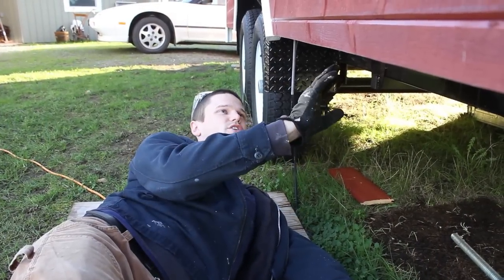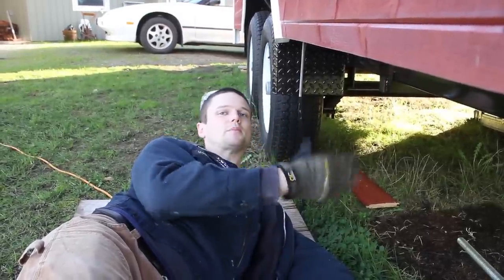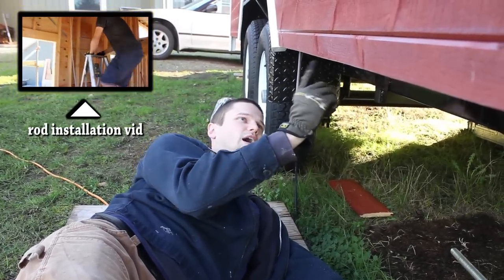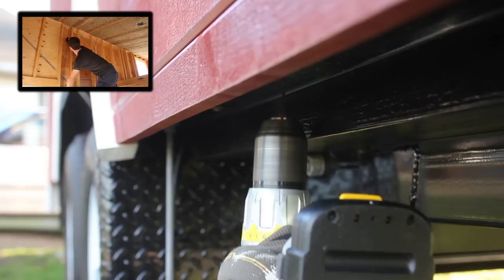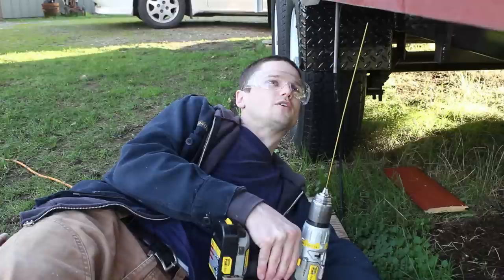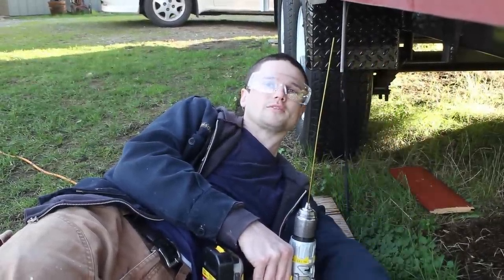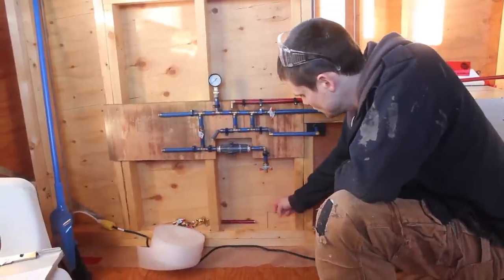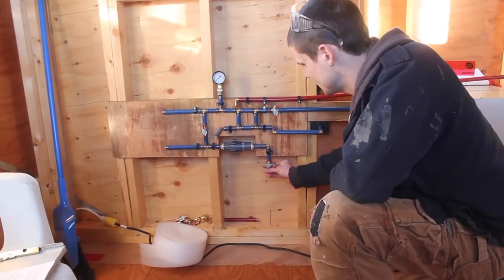Now that we've got the piping system positioned on the inside, I'm out here ready to drill through the flange — the hole that's going to accept the pipe that will connect to the incoming line. On the inside I measured off this rod to figure out how far over I need to be, and I'm going to start with the pilot hole. I'm going to use my favorite trick with a coat hanger in my drill to poke through my pilot hole, then check on the inside to make sure I'm in the right spot before I make a big hole in the metal. Here's my coat hanger poking through, and this is the main shutoff — it looks good. The pipe's going to come right through the future hole here and connect right onto that.